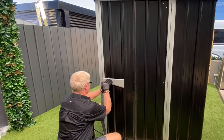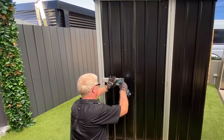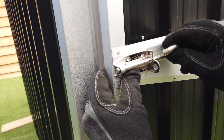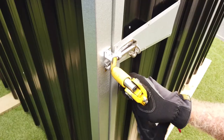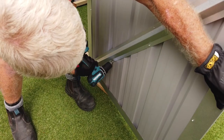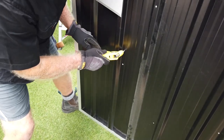Now Keith will add the finishing touches to the door. Mark and drill the pad bolt support, then attach the door. The pad bolt should be lined up to the edge of the door and attached, and the bracket attached to the jamb. Complete the riveting of the door braces, drilling from the back through the pan to the cladding and riveting through from the front.